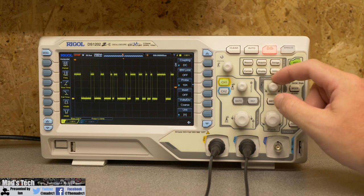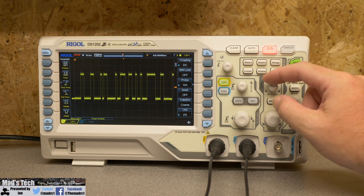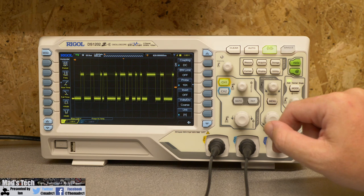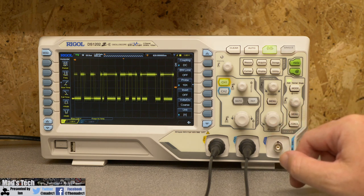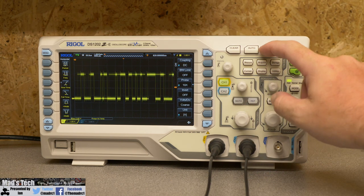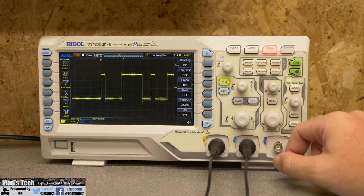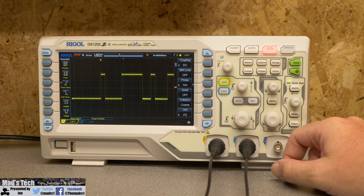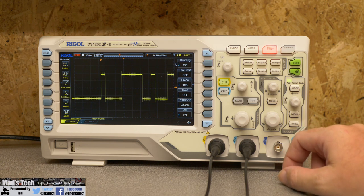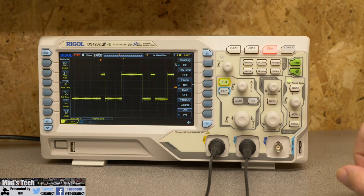Because this is a freeze frame, we're looking at a snapshot of the signal as it was coming in live. If I move the scope to run, you can see the data changing as it comes through. Stopping it again gives us a freeze frame to examine. This is the standard frame of data from the FR Sky input — classed as inverted compared to Futaba — where ground at the bottom is logic zero and the positive voltage is logic one.